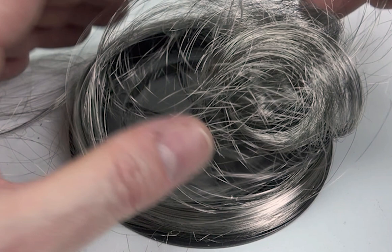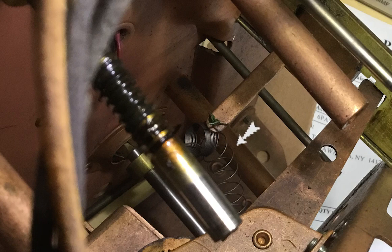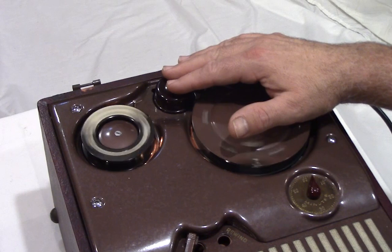When John's wire recorder stopped working correctly, it was determined that the spring assisting in the downward movement of the head had snapped in two. To compensate for this, I'm demonstrating here what John had to do in order to operate the unit. Once the head completes its upward movement, he would place his hand on the head and push down against the drive system. When the head starts moving back up, he would remove his hand. Imagine doing this for over an hour.